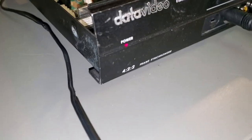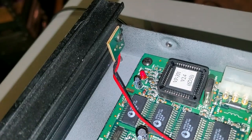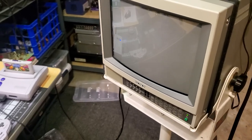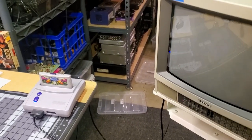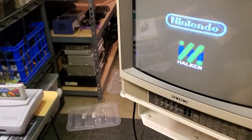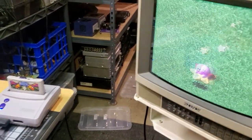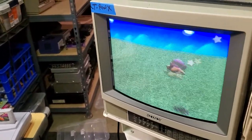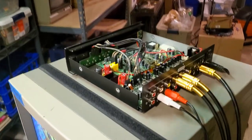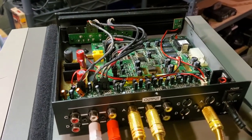Let's go ahead and power it on. If it's working, the light should kick on here. You can see we've also got an LED light that switches on and off right here if it's working. Let's turn on the screen and see what we have — we have audio, we have video. This is composite NTSC. We've also got S-video working. I'll run through and test the rest of these outputs, put the ferrite cores in place, close this one up, and we'll have two serviced units ready to go.